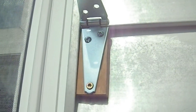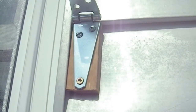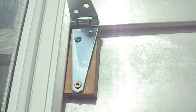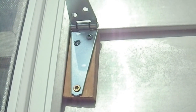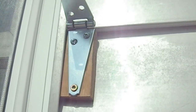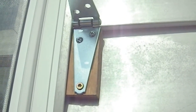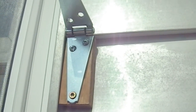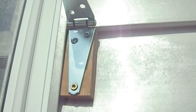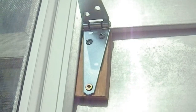My wife was correct — that did work. Though I did have to open up the hole in the siding to a five-sixteenths because the plastic sleeves normally go into drywall which has a little give. Obviously the aluminum siding does not, and it has sharp edges. Getting them in was a bit of a trick, but I did it. Now I'm going to do the same thing on the other side and see if it works as well.